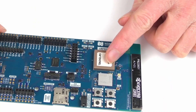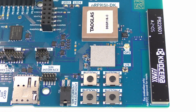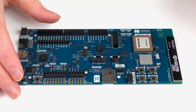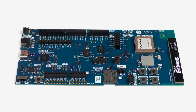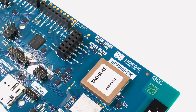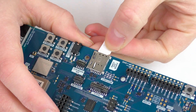Sitting next to it is an integrated GNSS antenna with a couple of micro-FL connectors for attaching external antennas. For the I/O, the NRF9151 development kit has many options when it comes to adding extra capabilities. There are four user-programmable buttons below the SIP, while four user-programmable LEDs are above the GNSS antenna. There is also a nano-SIM card slot here, along with pads for soldering an eSIM.